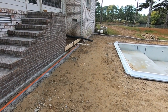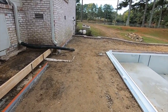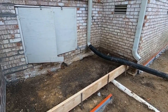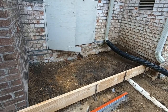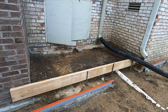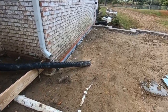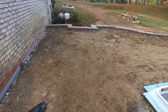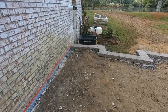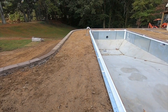This drain goes all the way around, sloping everything from the pool down to that drain and away. Back here we had to do a little custom work because our septic line comes out from the other house and there's the old foundation — we had to do a little step up, almost like a small retaining wall. The concrete steps up about eight or nine inches so we can have a little seat, put a small couch there. All the concrete comes to this drain, catches in that gray drain, goes out the wall against the house — no water going back under the house.